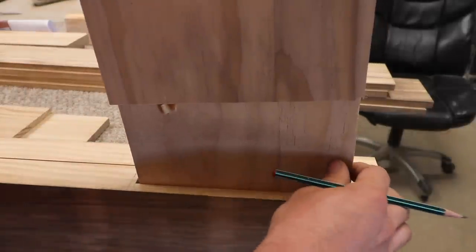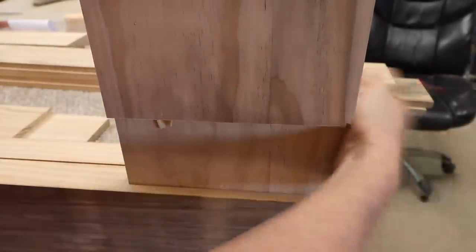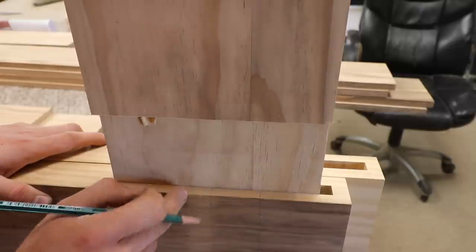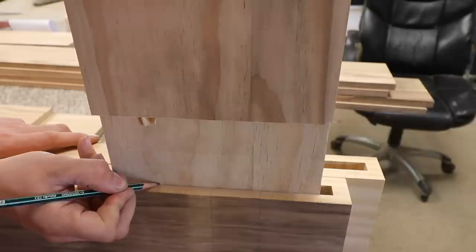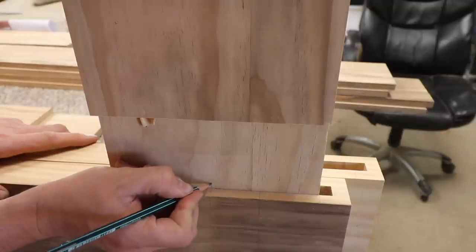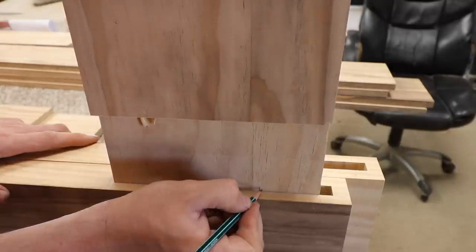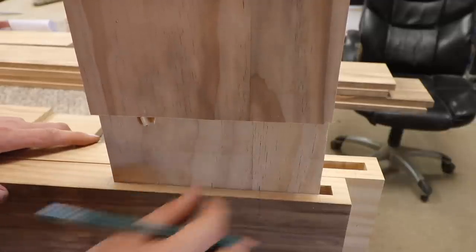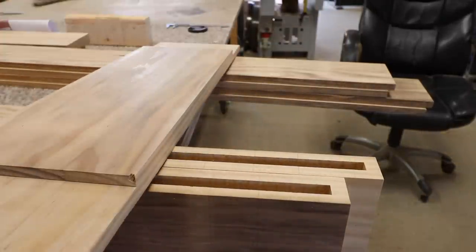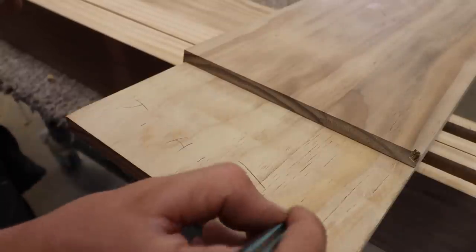It's the same principle on the bottom rail. Cut in that rail. It's a tiny bit tight. So we're marking the tenons, which is this one and this one, and the haunches there and there. On the tenons, we're just coming slightly inside of the line. Because that's tight up against here, this one can be tight up against there. And then on the other side, we just want that tiny bit of wiggle room. So about half a mil to a millimetre inside of that line to make the tenon smaller than the mortise. And from them three tick lines, we can go back to our combi square and set the joint out. So this is a tenon, that's a tenon, that's a haunch, that's a haunch.